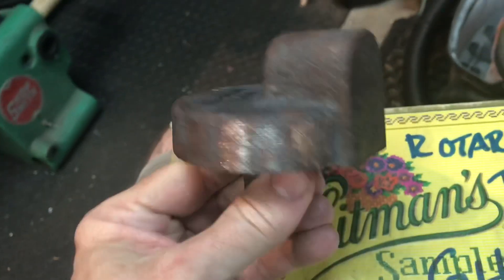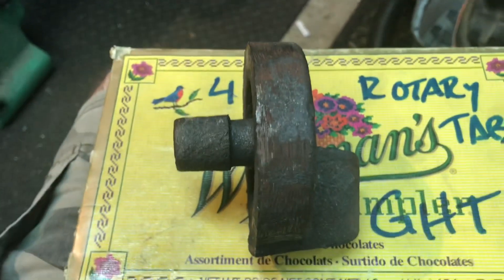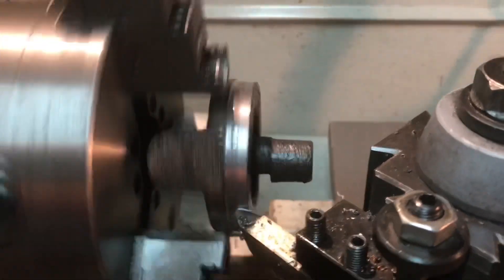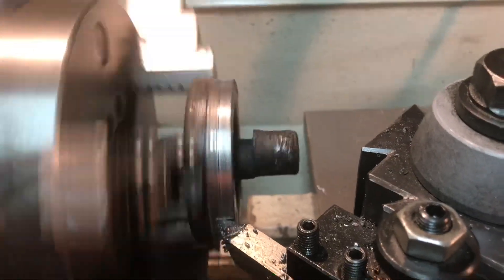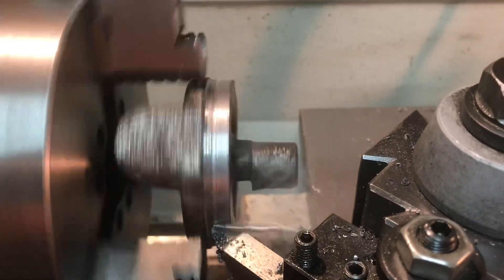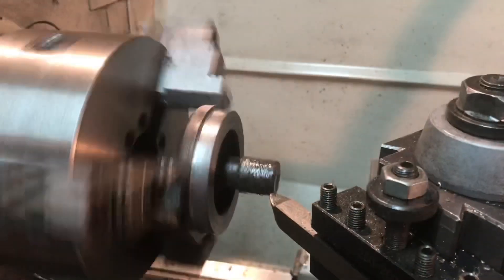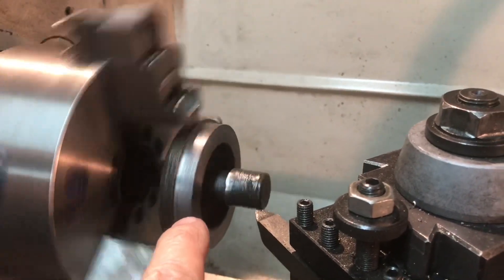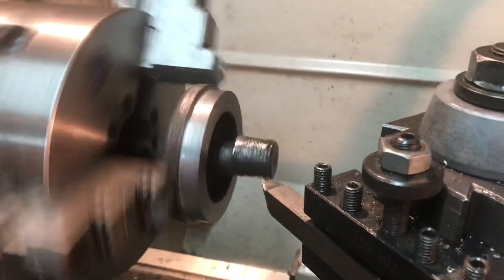So that's just a little teaser there. I'll start to update you as I start working on this thing. The bottom half of the rotating base is cleaned up nice - got rid of the interrupted cut, looking good. I'm going to leave about 20 thou extra of diameter because I'm obviously going to have to clean up the overall thing, so I'll leave myself a little extra for some finishing cuts. I've cleaned up the outside, left 20 thou on the outer edge - so it's 3 inches and 20 thou. And then I faced off the bottom.